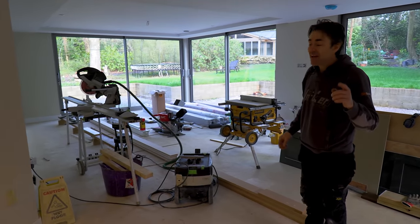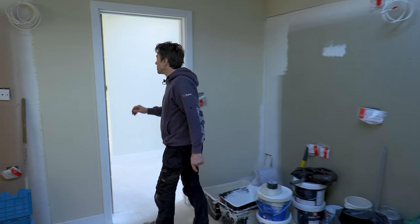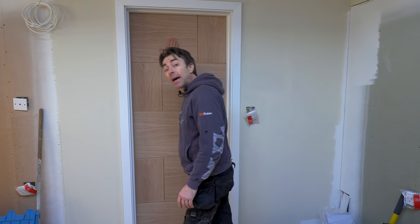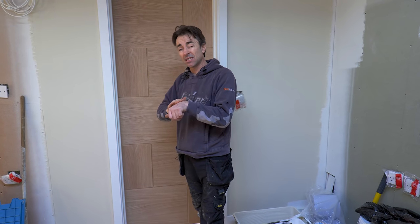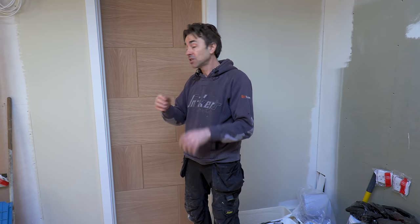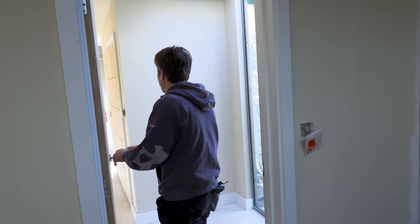We're using dust extraction because I don't want much dust in here. All of the doors are primed up and there are some here which are unfinished oak — these are also from XL Joinery, the Rowena. The reason these are unfinished oak is because we're going to paint them. We didn't want to paint over a pre-finished walnut one because it has a kind of wax on it. Oak paints particularly well — you get a bit of life coming through it, especially with eggshell, so you're going to read the grain, which I think is really important with this style.